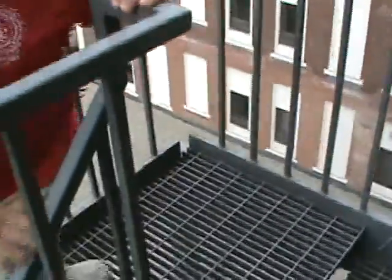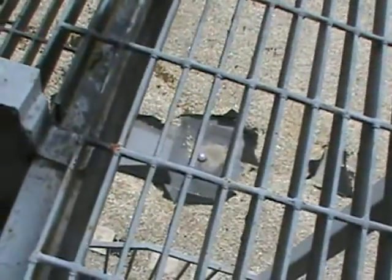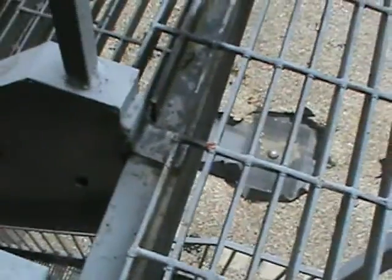We got a major point right here, the E-clip. We got this area right here. This is holding the hole with a weld. This needs to have a bolt secure this to the fire escape. We need to do a better job sealing these major connections. We got a good example right here. If you can catch this rust already here in between, it needs to be sealed real well, real tight with 50-year silicone. Again, on the sides here, you can see the water penetrating.